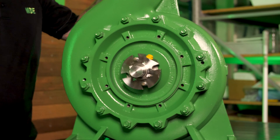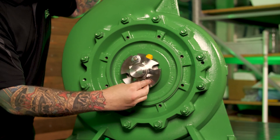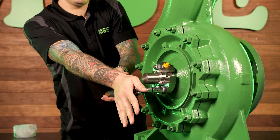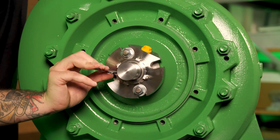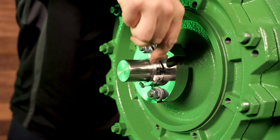For the purpose of this video I omitted the bearing housing. Once the backplate, volute and impeller are in position, the cartridge seal gland plate can be bolted to the stuffing box or housing. The next step is to tighten the grub screws — it is important to do this after the gland bolts are tightened to make sure that the cartridge sleeve is still in the correct position in relation to the gland.